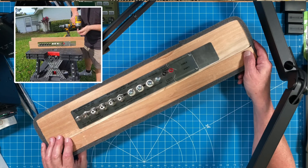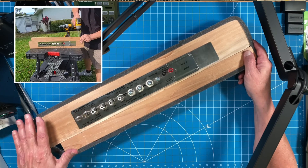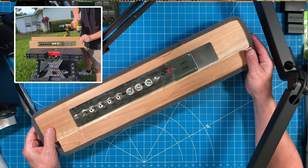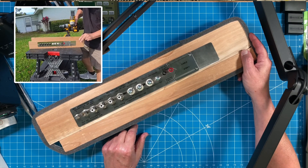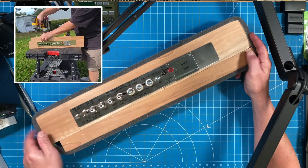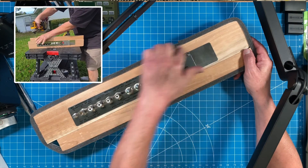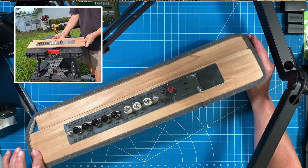Pre-drill and screw — pre-drill this or you'll split it. Then give this whole thing a coat of paint inside and out. Whatever color you have on the outside of your home or your windows, try to blend this in. If you removed all of this and painted it all inside and out, that would be phenomenal. At a minimum, get a coat of paint around this, especially on the outside. It's going to help this weather and last better.